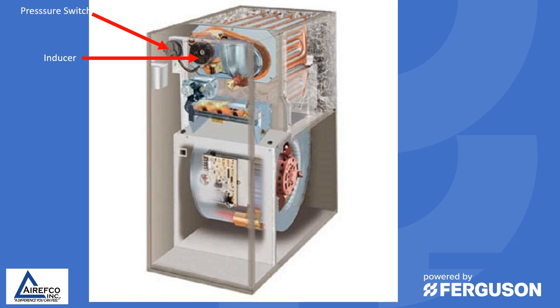Make sure the pressure switches operate correctly as they are safeties for the correct operation of the furnace. The gas valve is another item that is most often misdiagnosed. I had a tech the other day who was condemning the gas valve, ready to replace it. I asked him to check the voltage coming from the control board to the gas valve, and he found that when the gas valve was dropping out, the voltage from the control board was dropping out too. So it was not a gas valve issue — it was a control board issue. Properly diagnosing these components is very important.